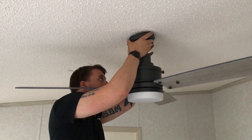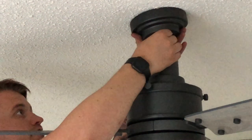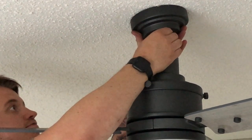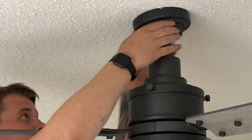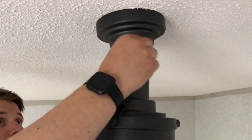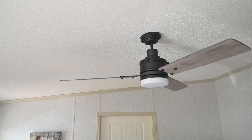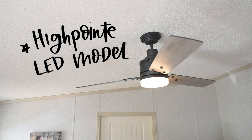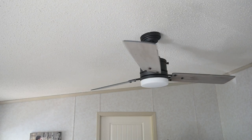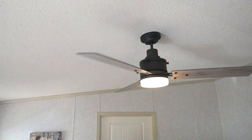Here's where the magic happens and what I didn't realize when I thought this was a really big deal. That ball, because it's a ball, is going to sit level. This is how the new fans are made so that regardless of the angle of the ceiling — or if your house is not level — the weight of the fan is going to keep it level. It needs to be level to spin without shaking. You know how old ceiling fans would really get shaking if they weren't level? These won't do that — it's on a ball joint system, so it will always be level. The face plate just goes up over that ball joint, and there's a hole in the center of the plate. Instead of just a cord coming down through it like a light fixture, you have the ball right there — so you can put that plate at any angle and it will not affect the fan moving whatsoever. It's really just a decorative piece to hide your wires, which is amazing for sloped ceilings.